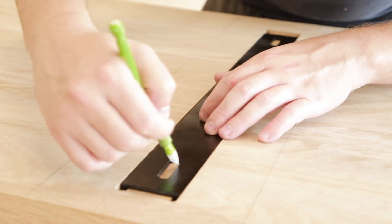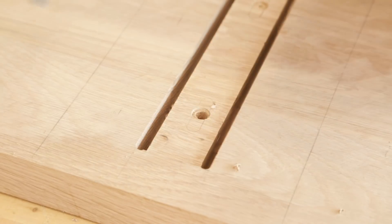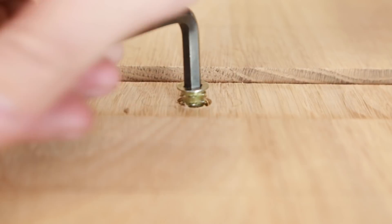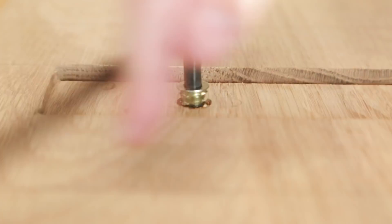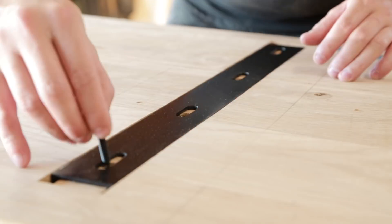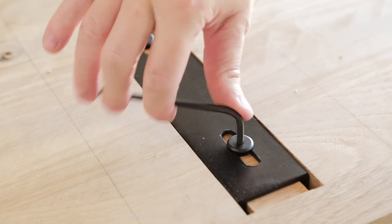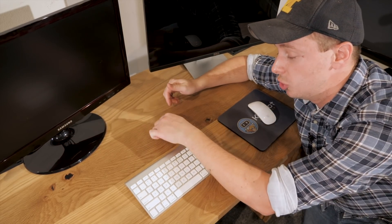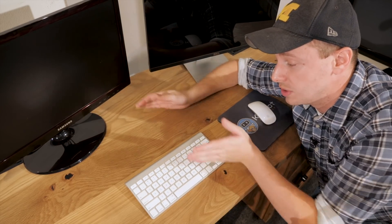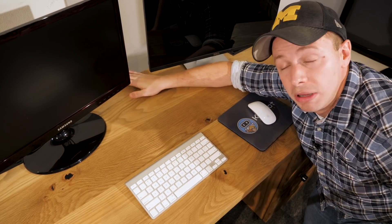To hold this in place, I am inserting some threaded inserts. Since white oak is pretty hard, I made sure to cut in and then back up here and there. I then used some CA glue to lock them in place. While adding the bolts, you want to tighten them enough so that it holds it down, but not so tight that nothing can move. The last bolt I did tighten down, so the tabletop can move forward and backwards from one point. I decided to do it from the back so that the table can go outwards and come back, fixed into place.